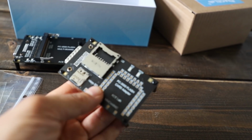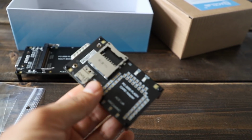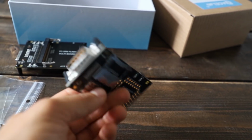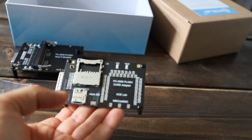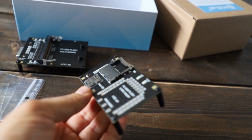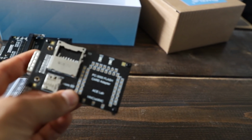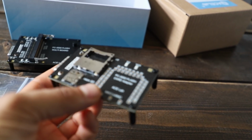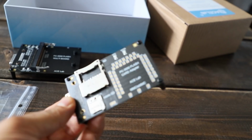So if the card still recognizes but it keeps dropping out, for example, and won't stay running long enough to transfer all of the data, this is the tool for the job. You could just slide it in there, and using the software and interface, it will talk to the card directly in a specific manner that will allow more control and won't drop out, and provide an image of what's on there. Once the image is collected, the data can be pulled from the image. This is a very useful tool for those devices that are not dead yet, but they are on the way there, and traditional adapters through USB do not help.